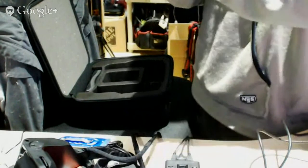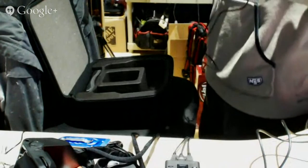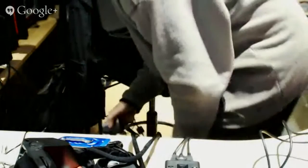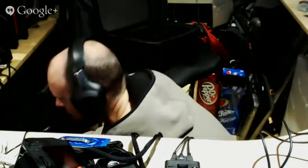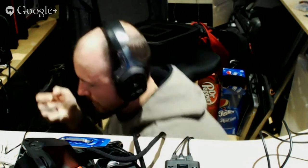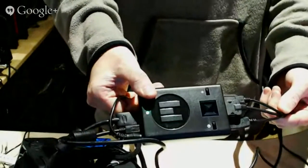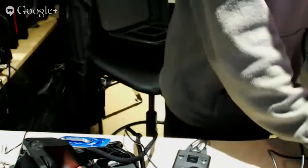And so the power adapter's pretty typical looking. 5-volt, 3-amp, wow. That's a hardcore USB power supply right there. You know, the first gen, the Oculus DK1 had a dedicated power adapter also that was just 5-volt, 1-amp. So I built a little adapter so I could power it off of USB and used little portable power supplies so that I could demo with my laptop and not have to go to AC plugs anywhere. And 3-amp is a little beefy. That's going to be a little hard to do off a computer, but I bet this could still be done, depending on how much draw it really has, off of a portable brick too. Okay, so we'll plug that bad boy in. So look at this busyness here. It's a whole lot. Okay, so I just heard a bunch of devices being plugged in on Windows.